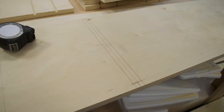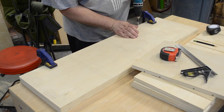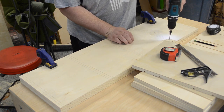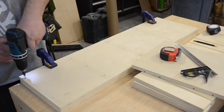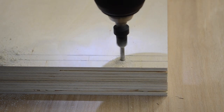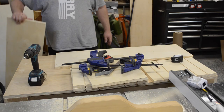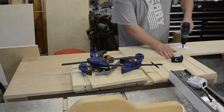I took a little extra time to mark out not only the center of all the dividers but also the ends, so that when I go to do assembly later it's going to help make sure everything stays in a nice line. I clamped both the top and bottom pieces together, then using a pilot drill bit with a countersink I drilled on that center line all the way through the top piece and just into the bottom piece a little bit so I knew exactly where that location was. Then I finished the through holes on the bottom piece and countersunk those as well.